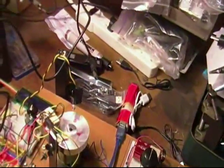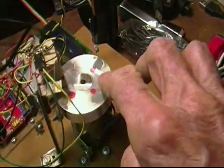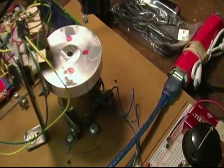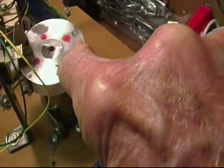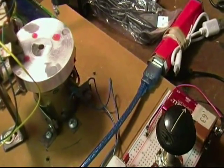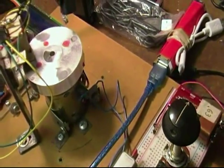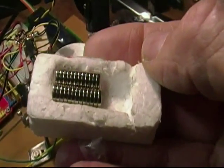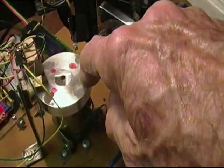So now what I've done is go to a four-pole rotor. You can see there are three red dots on here — those are all tiny magnets with the south poles facing out. The fourth one without a red dot is a magnet with the north pole facing out. These tiny magnets I bought on eBay, 30 of them, and they're very, very strong little magnets.